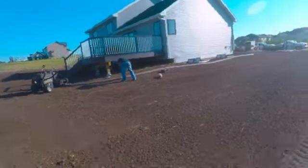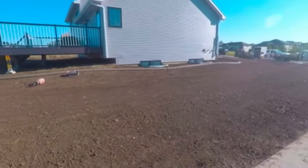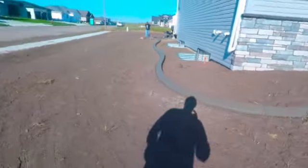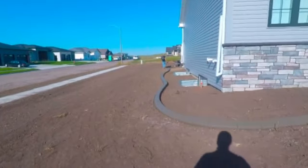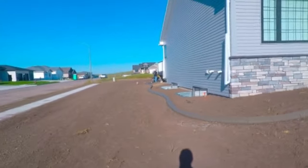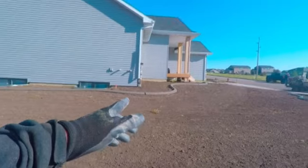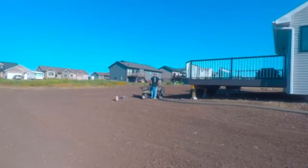As you get back from the street around the sidewalk, those curves flow real nice — anybody walking or driving by is going to see it looks really good. Now as a curbing professional looking down this line, to me the second wave doesn't really match the first and the third. I might be nitpicking, but when you run a machine long enough that's one of the things that bothers you. If you go back just a little ways and look at it from this angle it looks good. You have to be meticulous in how you run the machine because that's what people see right away. I can see drains placed there, there, and there — I'll get around this corner a little farther before I put my next one.